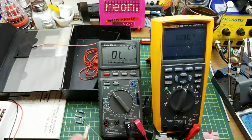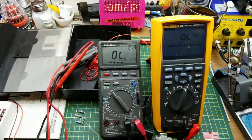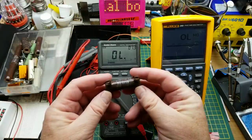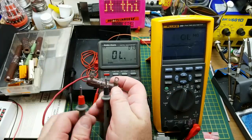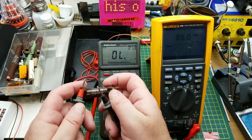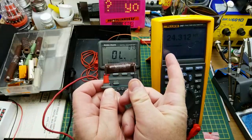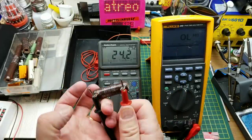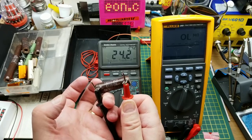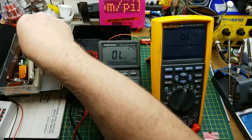Yeah, 0.15 / 0.16 — so not enough to throw a measurement like that off. Let's try a high resistance — how about 25k? There is that one: 24.312 / 24.313 — that's pretty bang-on for what it says.